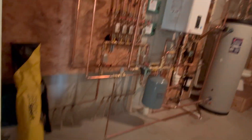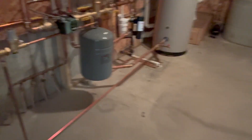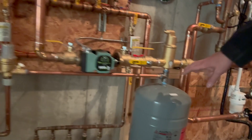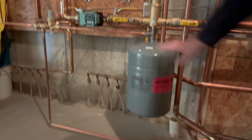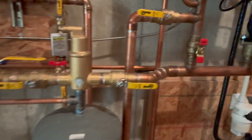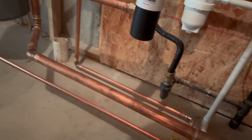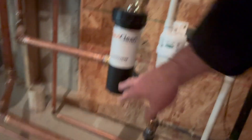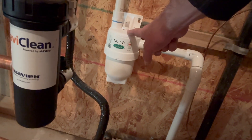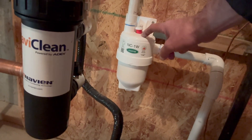I really cleaned up this entire area. We went to a 95% efficient fire tube boiler. We've got our nice Caleffi — we call it Caleffi — with the backflow preventer. We've got our nice big EX-60 expansion tank, and we added glycol to the system. We have a spiral vent for our air separator. We installed the Navi Clean because this had an old cast iron boiler — it has a magnet in it to remove all the iron deposits.